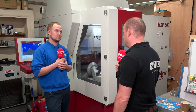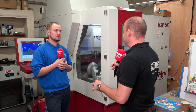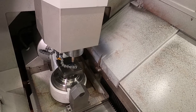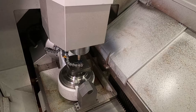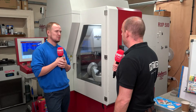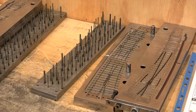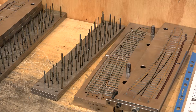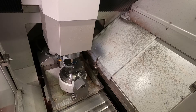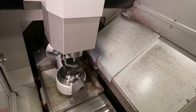When you're going up to 42,000 RPM, what determines machining at that speed — is it down to the size of cutter? Yes, the smaller the cutter you use, the more the spindle speed will go up to deal with the pressures and torques of machining. We use down to a 0.2mm cutter, which is incredibly small — you're talking about two pieces of A4 paper pushed together. We will generally use very small depth of cut, and the majority of what we use is waveform machining.